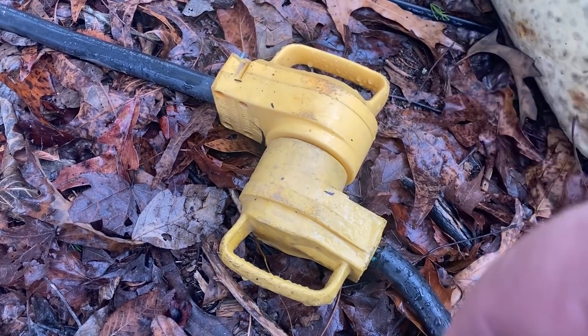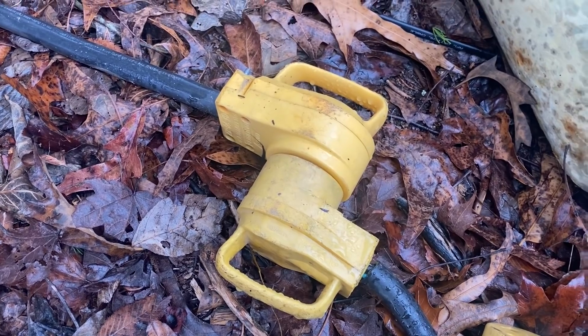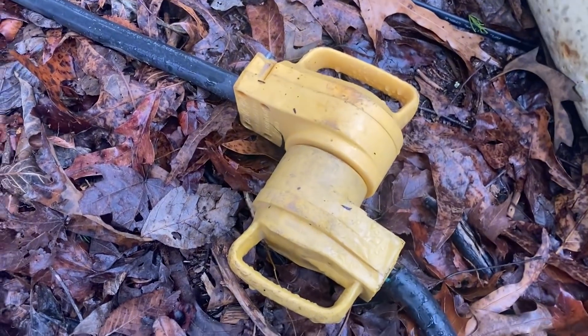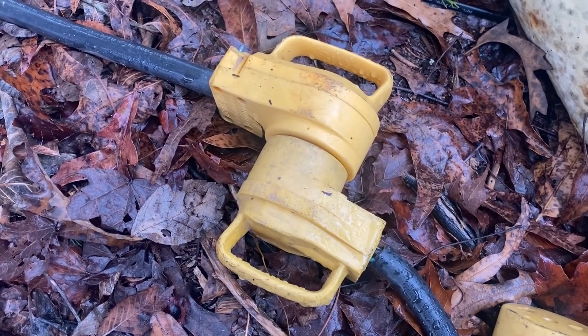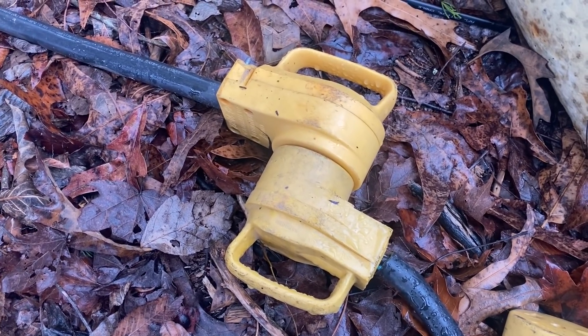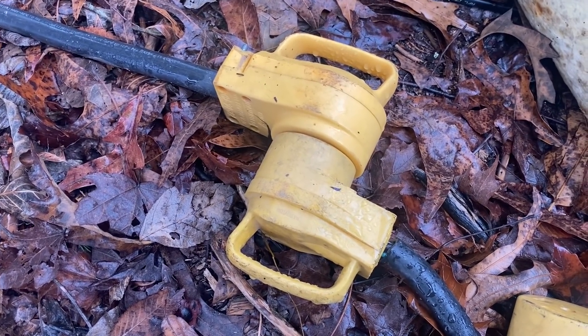So I haven't dropped a leg here — from here I know we're good. The bus at the end of this wire is getting 220, it has two legs of 120. So I'm going to research it from there, eliminate the easiest things first before I start taking stuff apart. The power is being supplied to the bus but it goes from here to a transfer switch and then from there to the inverters, so I'll have to check and see what's going on. It's unusual that it would just drop a leg, but trying to figure it out.